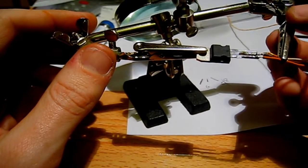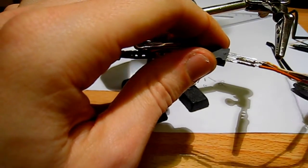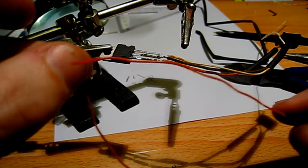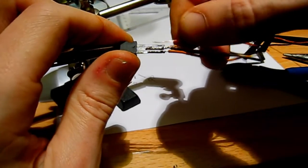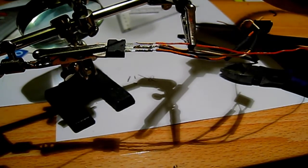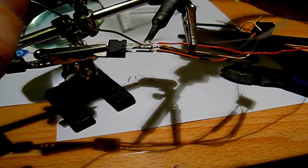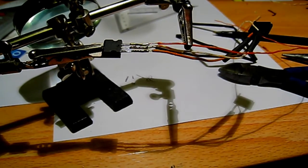You should have noticed something when I did that one — you'd realise that I forgot to put a bit of heat shrink tubing on there, but don't worry, I didn't. There's only one pin left, and that is for your other piece of your live coloured wire — orange for me — that goes on the other end, which is the output one, the one on the right of the regulator. You are going to have to apply a bit of solder for this one because the end of the wire isn't pre-soldered, so clean your tip, apply heat to the joint, add some solder.